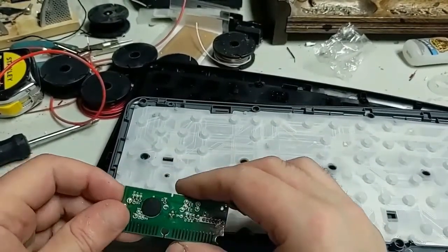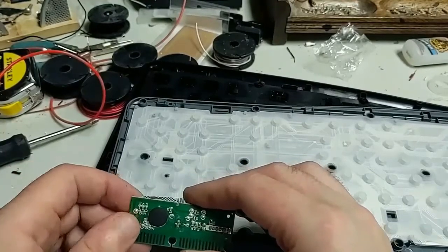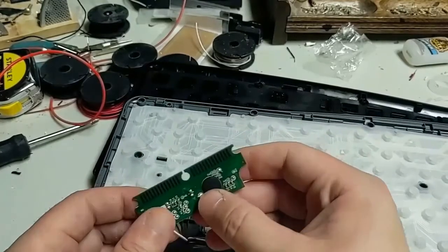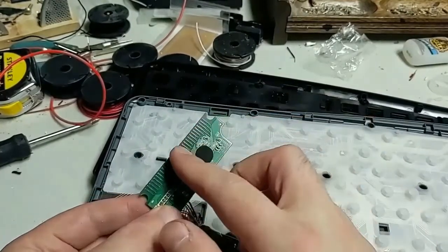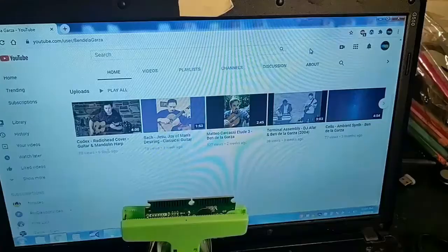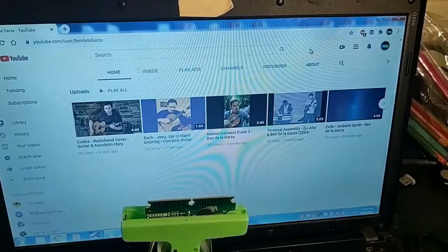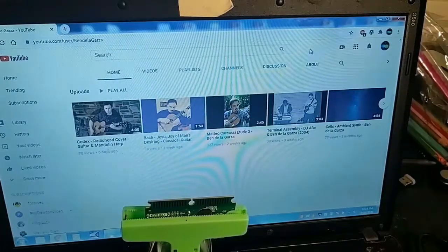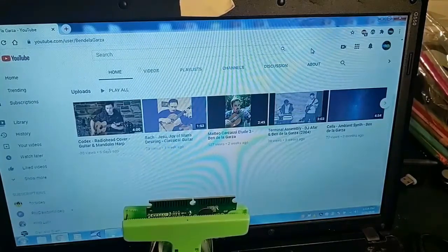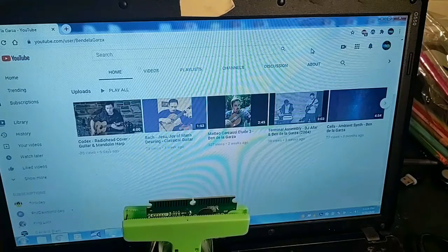So it's got one digital chip, which I presume is housing all the functions for this keyboard. And then you've got a bunch of little conductive strips here that the keyboard matrix is connected to. So I've gone through the trouble of finding which connections create the keyboard functions that I'm looking for. That way it saves you some trouble, or you can find your own keyboard functions by troubleshooting it yourself. But anyway, I wanted up the screen, down the screen, tab to go from link to link, and then enter to visit those links.